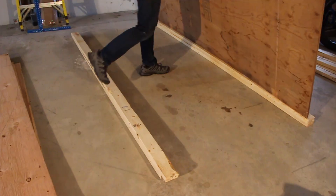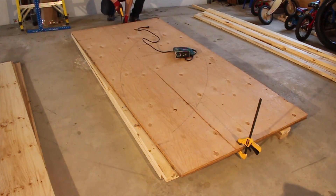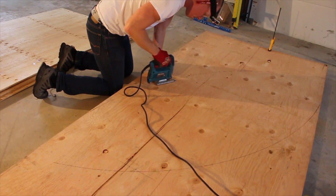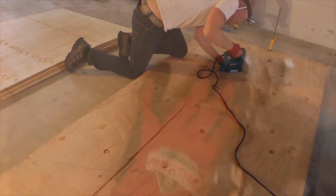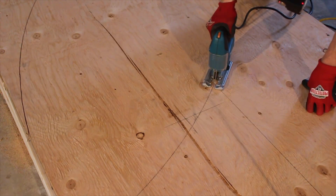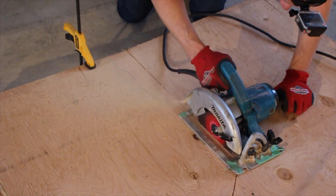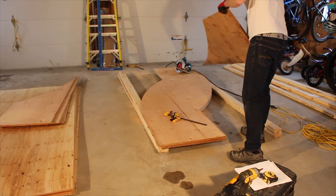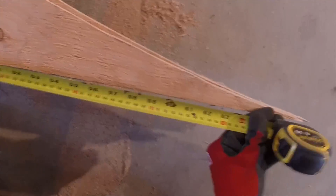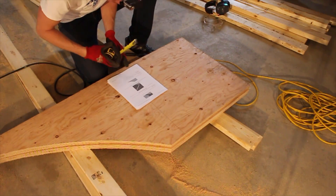Using four 2x4s to elevate the plywood off the floor, I decided to sandwich the two sheets of 5/8 inch plywood to speed up the process. I'm making two ramps so I need two sheets — one sheet for each ramp. I held the sheets together with clamps so they didn't move apart. Using a jigsaw to make the curved cuts, follow the line as best you can — this doesn't have to be absolutely perfect, and most mistakes will be forgiven when the ramp is put together. Follow the curved line to the line that intersects it. With a circular saw or jigsaw, make the straight cut. Notice the shape of my leftover material — I messed up, so follow the plans more closely to save time later. Measure along the bottom edge of the ramp to 61 and a quarter inches, then cut the end of the ramp square at this point. Do this for all four ramp sides.